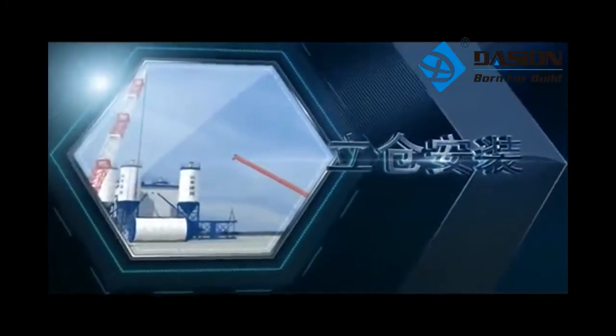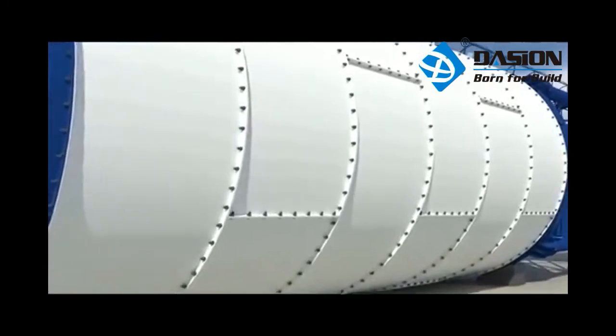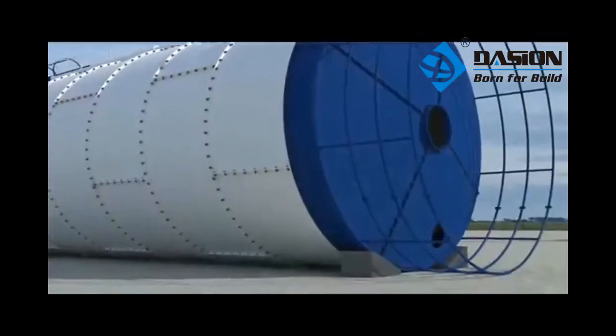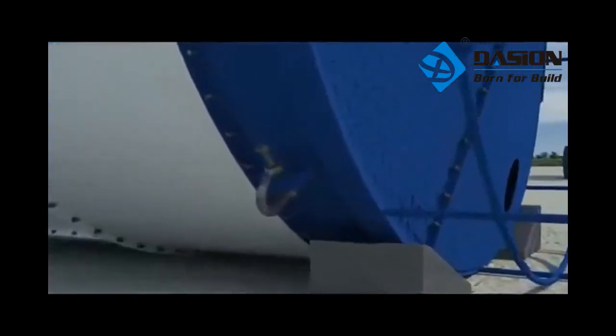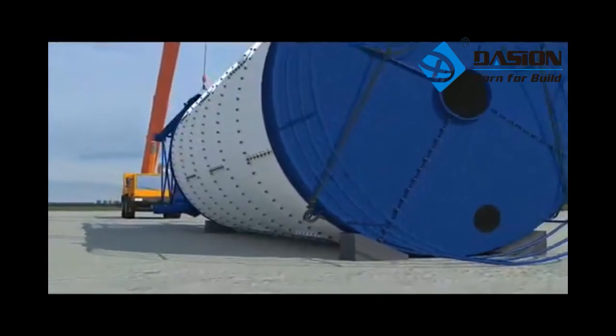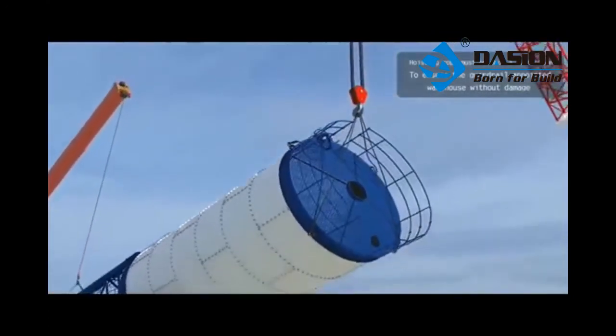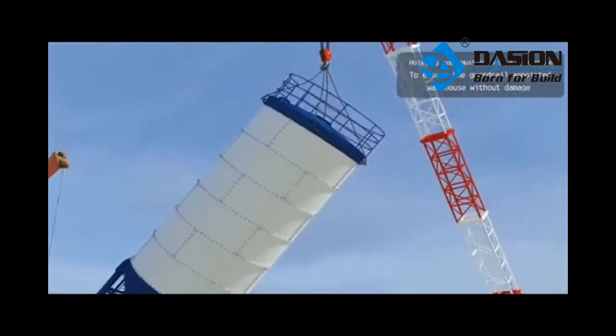Installation of a vertical beam. Tighten all bolts of a tank body once before installation of a vertical beam. Bolts may be loose due to a stack of beam and disturbance of a beam body. When lifting the vertical beam, the beams with a 13-ton or more shall be lifted by more than 50-ton crane. In addition, one more than 16-ton crane is used to lift the rear leg.